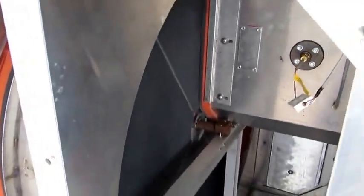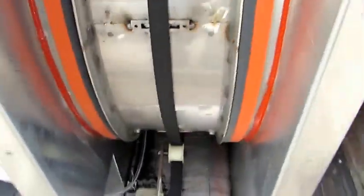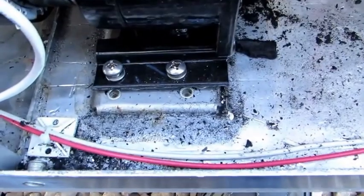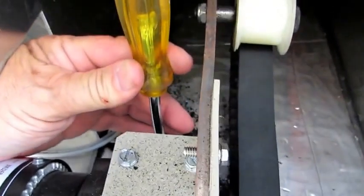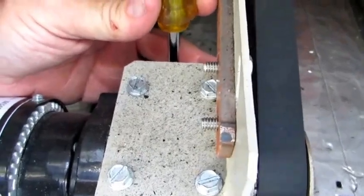And so what we're going to do is roll this rotor here out. You can see the permanent desiccant rotor here. Oh, watch out for the hurricane clips. And so we're gonna take that out. I got to take this little motor loose, take some screws out here. We'll get to that in a minute. Now taking these motor screws out here, you can get to the front too just fine. But the back one here, you're gonna have to kind of work blind. Get your hand back there, feel where you're putting the screwdriver.